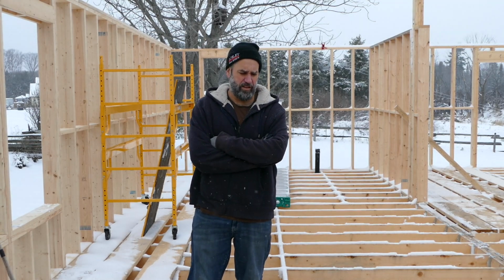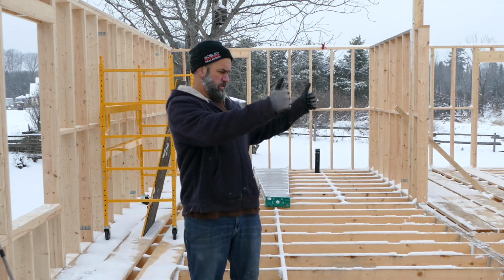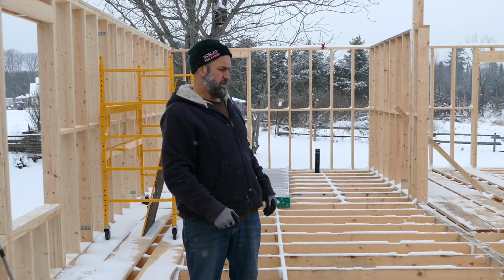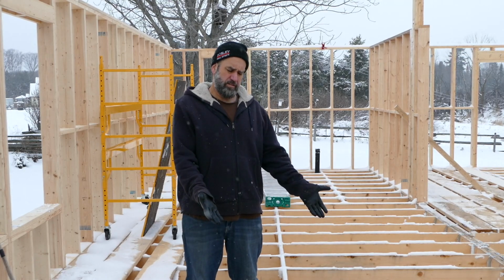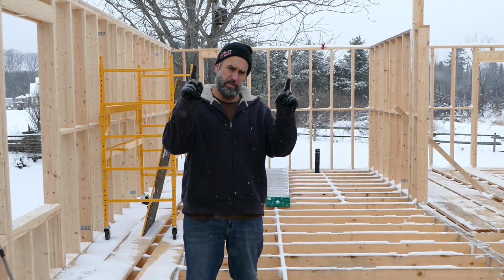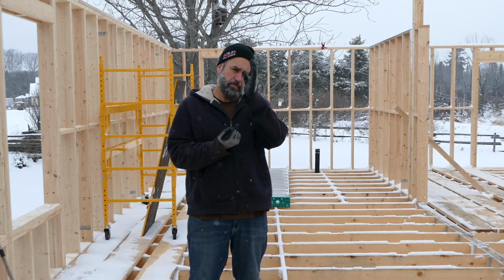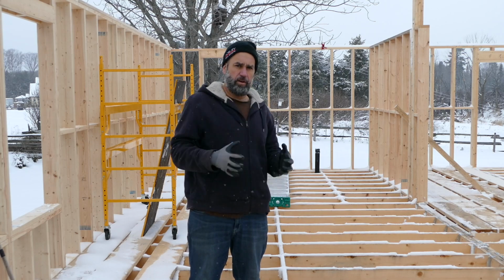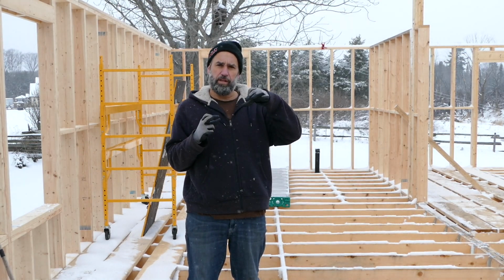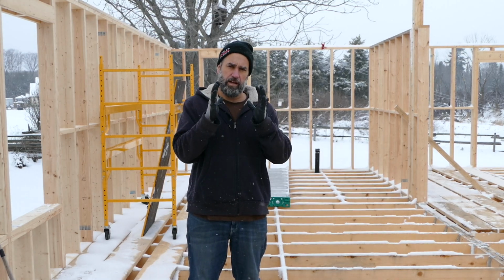And now today we are going to put up the 2 columns that will go on either side of the fireplace. They're pretty much freestanding. What I'm doing is just affixing 2x6 sections, like a couple pieces of 2x6, and I've cut them out kind of eye-shaped so that they're flush with the 4.5 inches of the column. I'm going to timberlock screw them through the bottom as well as nail them, and then we're going to put them up, timberlock screw them down, and I have a couple of 12 gauge steel plates that I will use Simpson strong tie structural screws and affix that into place.